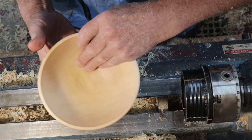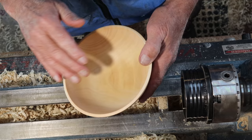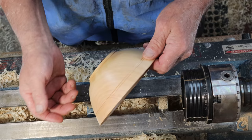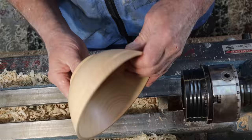I noticed with your finish there, you put wax on first. Did I? Just on the inside. Oh right. I'm pretty casual about finishing — I just think about the utilitarian picture of the bowl, that could be why. It's just being casual too, possibly. But there are a few little kind of marks in there, and if I look very carefully there are little sanding marks from the 240 grit. And it would be the same if I went down to finer grits — 400 or so or even finer. We tend to get far too precious with these things, but that's a really quite a nice little bowl. Thank you very much.